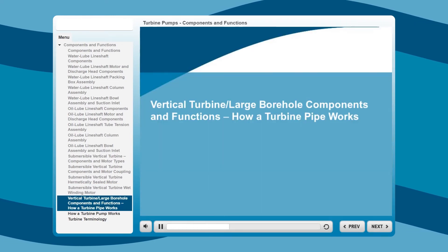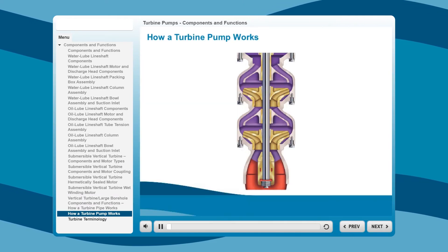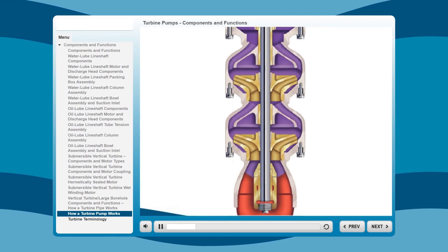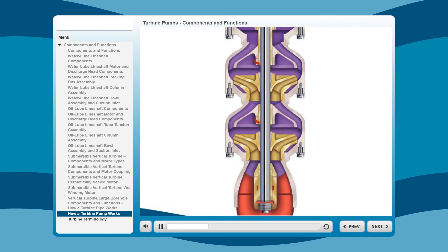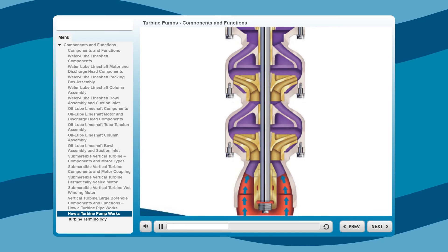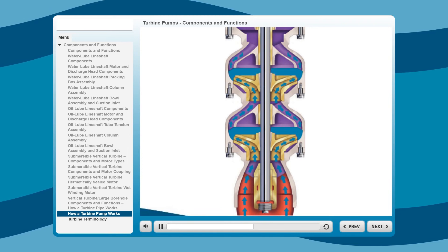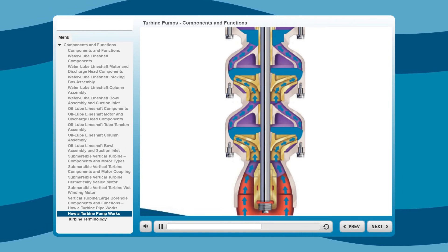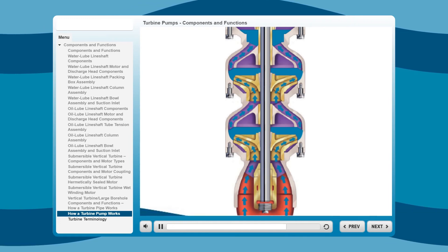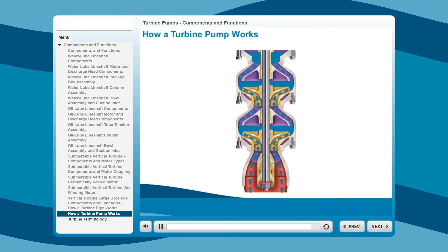In this section, we'll examine exactly how a vertical turbine pump works. Inside a standard vertical turbine, the rotating line shaft turns the impellers in each bowl, providing velocity energy to the fluid. The bowl collects the fluid from the impeller and directs it up to the next bowl or to the discharge head. As the fluid flows through the impeller outlet, it passes through multiple cut water diffusers inside the bowl to balance the hydraulic radial thrust, which is created by the lateral pressure generated by the rotating forces. Adding stages increases the head pressure to create the desired pressure needed at discharge.